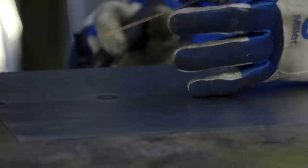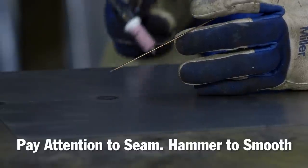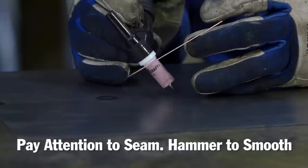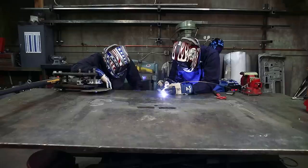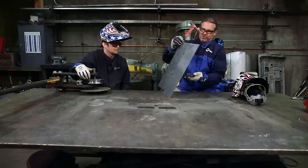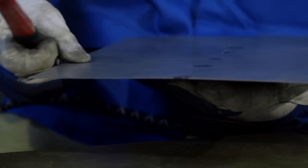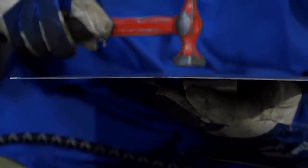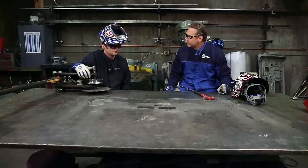As you're going, you've got to watch and keep your nice seam. You can see this is raising a little bit — it'll go together or apart. Right now I can hold this down without any filler rod. I can just tack these two pieces to tighten up the gap. You can hear it move — you can see the whole piece moving. So I can see that I need to hammer it on both sides. I just keep going down the line and keep that straight piece of metal.